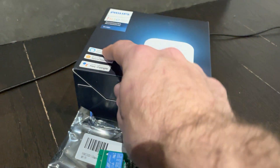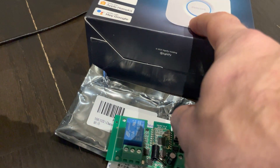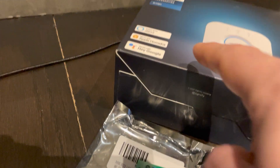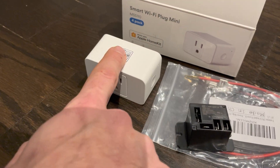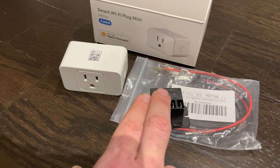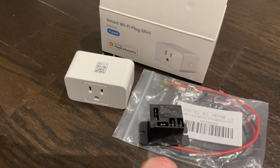So in recap: with the Philips Hue bridge, although I do have compatibility with multiple home systems, this is not a HomeKit accessory and so it cannot be exported outside of Philips Hue. This accessory uses Zigbee to communicate with Philips Hue and can peer with multiple external home automation solutions. For Apple HomeKit on the other hand, I'm using a HomeKit licensed device for control, and I am triggering a relay which in turn is controlling the fireplace circuit. Thanks for watching — feel free to post any questions. Have a good one.